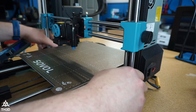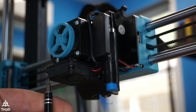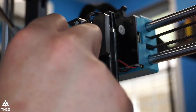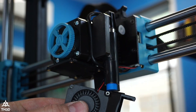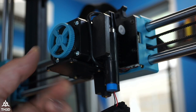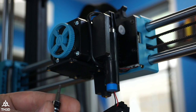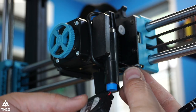We're going to go over removing the stock cooling, splicing the fan wires in, and then mounting everything up to the printer. Go ahead and raise the Z up so we have some room to work under the hot end. The fan we're replacing is the layer fan right here — it comes off with two screws on each side. I'm using a 1.5 millimeter hex bit. The fan is now removed. There are two more screws under here to get this bracket off, and those need a 2.5 millimeter hex bit.